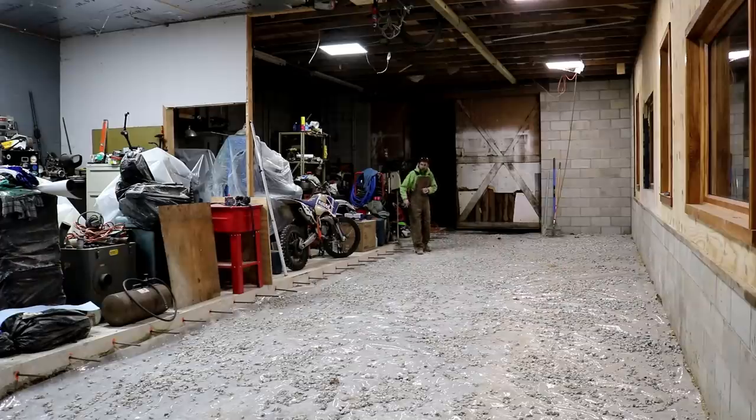Now, I've pinned to the existing pad here every 15 inches, right, to tie the new and the old pad together. It probably would have been fine every 24, but whatever, we did every 15. I don't plan to put concrete pins, with rebar, into the wall here, because I don't think that's necessary with my setup. I've had a large trench all the way around that wall that I poured flowable fill into, which is a non-settling, basically cementitious mix. It's concrete, really, all the way along that wall and along the front and the back. So my concrete pad is going to be sitting on concrete that's sitting on top of the foundation, which means that the whole wall would have to move for this pad to move out at the end. So there's no reason to pin it, in my opinion. I am going to have an expansion joint around there, but that's it.